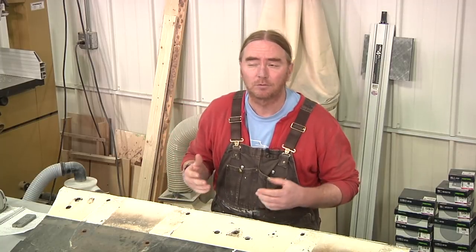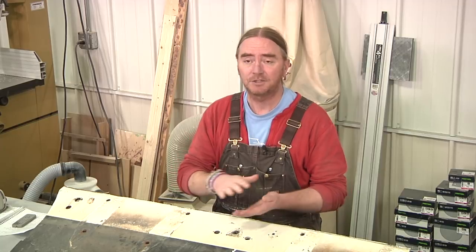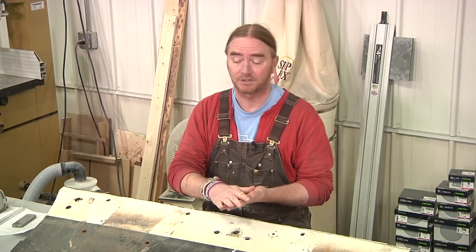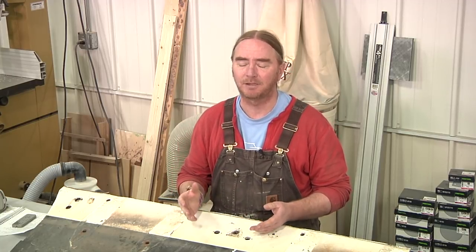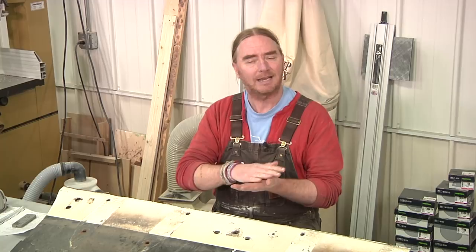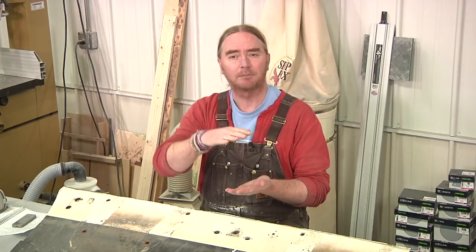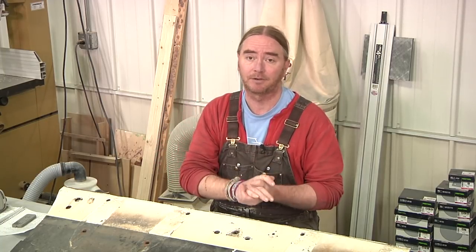So now my general rule of thumb is that holes that are, say, a quarter inch or smaller, when you're using this compound, can just be filled, sanded flush, and then finished. Holes that are larger than that, as a bit of a belt and suspenders approach, you really need to have a bit of a glass skin over top of them. So the larger holes will be getting filled, sanded in with a little bit of a dimple, with a couple layers of chop strand matting over top, sanded flush, and then you're going to be ready for finishing.